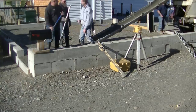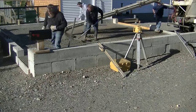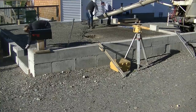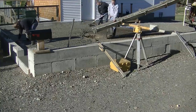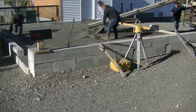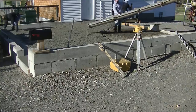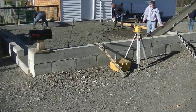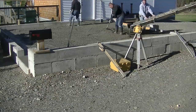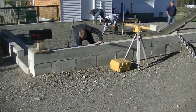There's about ten yards of concrete on this truck. We're going to get three-quarters of it poured out before we start screeding. We're pouring at about a five-and-a-half to six inch slump. Slump is how wet or dry the concrete comes out of the truck — rated between zero and ten. A three or four inch slump is pretty dry, five and six is workable, and above six — seven, eight, nine — that's pretty wet, too wet to do floors with.